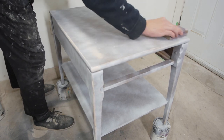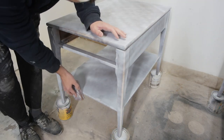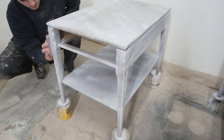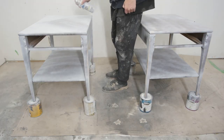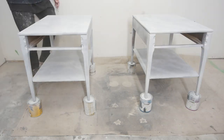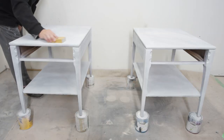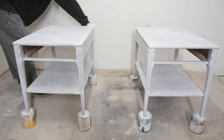In between every layer of paint — whether it's primer or the topcoat — I like to use my 220 grit sanding sponge and go over the entire project. Sanding between coats helps each layer adhere better and keeps everything as smooth as possible. Remember, if you sand between a coat you need to wipe up any dust. Then I apply another coat of primer to each piece, and after sanding again with 220 grit and wiping it up, we can start on the actual white paint.